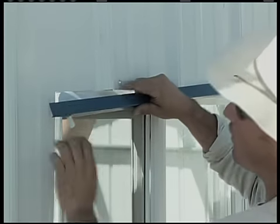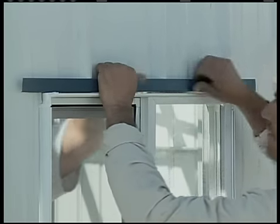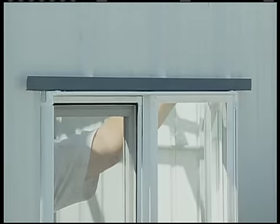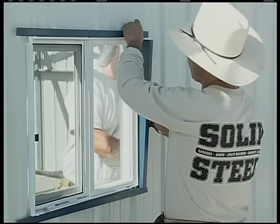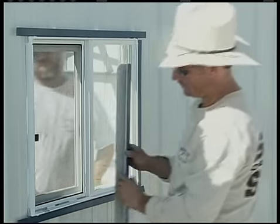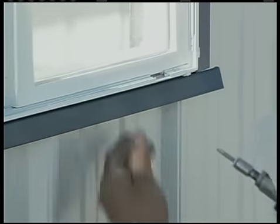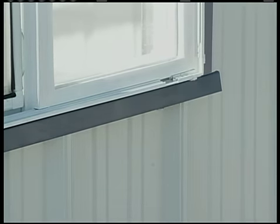We cut all the various pieces of trim for all that. Now, after you've placed the pre-hung pedestrian door into its frame and secured it to the frame with the frame screws, you're going to take the J trim you cut before and slip those pieces under the wall panel pieces. Remember how we didn't attach the wall pieces right next to the door and window openings? This is why. We have to slip the J trim under the unattached wall panels and then, using one screw to go through both the J trim and the wall panels, attach them right through and into the building frame.